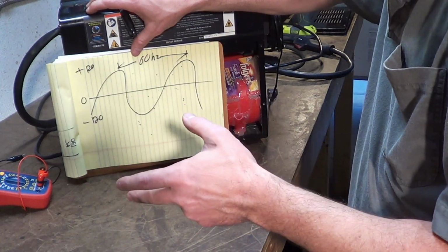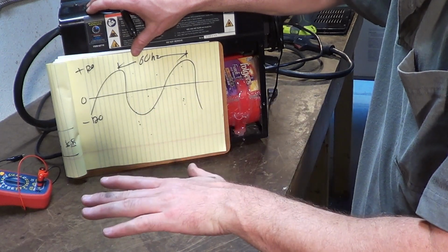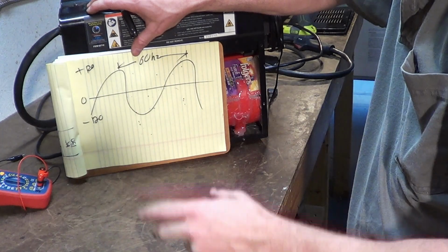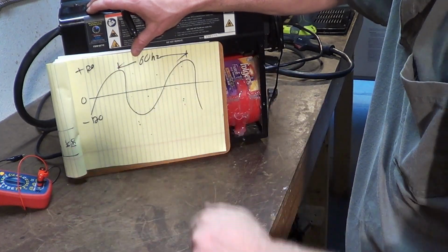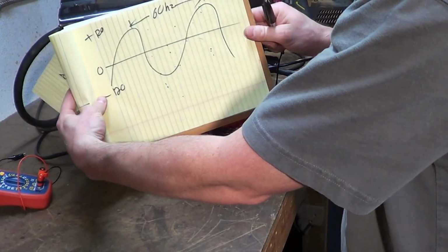I had a very hard time with this machine making welds that would wet in and lay flat, so to speak, in a joint. They all tended to want to sit proud, and it was very difficult to get it to wet in and penetrate fully. Much better after the DC conversion. DC, okay, that's AC.